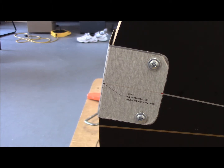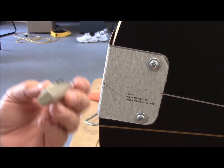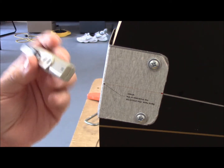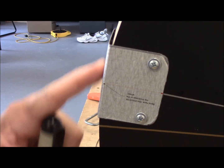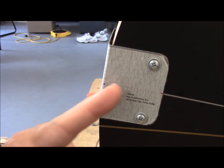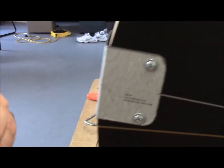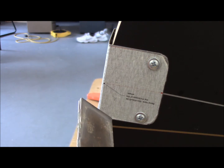I have eight magnets mounted on my wheel. My magnets are two inches long by one inch wide by three-eighths of an inch deep. I've also gone ahead and put the metal laminates behind the magnets — they flew right on there. My laminates are about three-sixteenths of an inch thick.